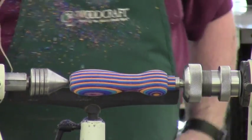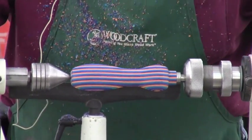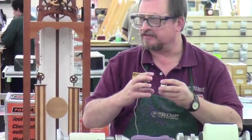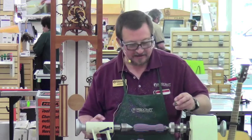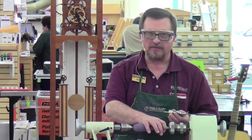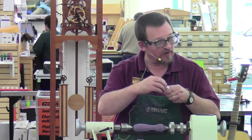Save the watch — it's way too late for the boots, right? And that's a really good question. The thing to keep in mind is how accurate — how dare I say anal — do you want to be with this thing? Certainly, you can turn this end so that it comes right down and just blends right into the metal and kind of makes a seamless little fit. And that's usually what I try to do. The advantage is that once this is all together and screwed in with the tenon up in there, if you don't have any exposed end grain here, it's much better off. There's much less chance that any kind of moisture is going to infiltrate into your handle. So you really do want to try to get down to where it just kind of blends right into the metal there.